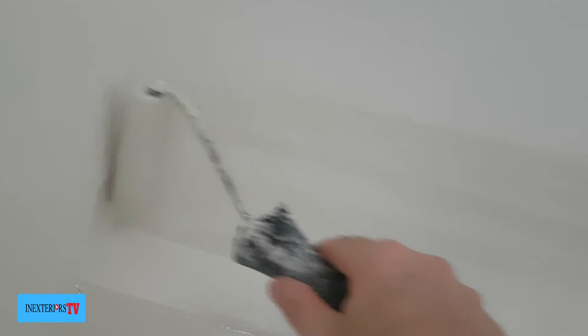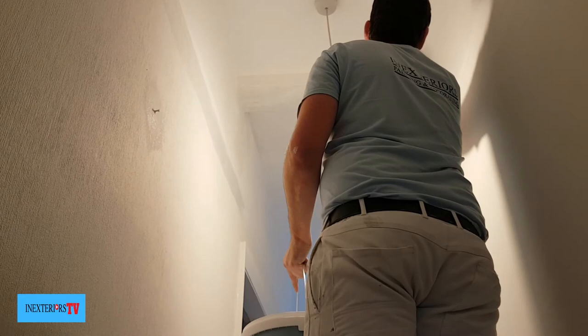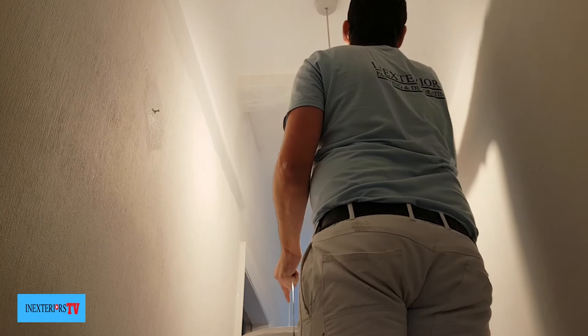Just to let you know, in the middle of all this I managed to fill and caulk any gaps or cracks. If you want to do all this in the same day, then shellac-based Zinsser stain block is probably the best option. But if you're in no rush, undercoat is definitely your next best alternative, and I use it all the time — it has never let me down.